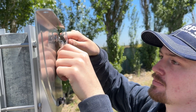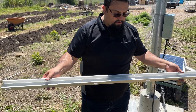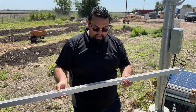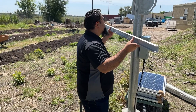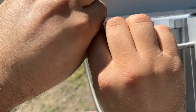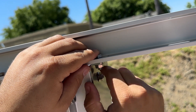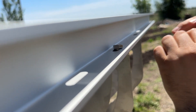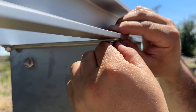Now, Miner will tell us a little bit about mounting the extension rails to the tilt bracket. So, I have here one of our extension rails. We're going to want to make sure that the C shape is facing outward away from the mount and that we have our two slots on the bottom and our four slots on top. Using the five-sixteenth inch bolts labeled J in the manual, secure the extension rails to the tiltable bracket. Ensure that the C shape of the rail is facing away from the center of the pole and that the side with the four holes is facing up. Align the two rails so they extend the same amount on both sides and tighten all four bolts.